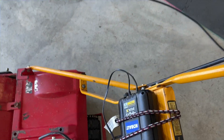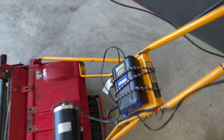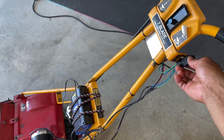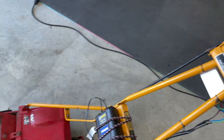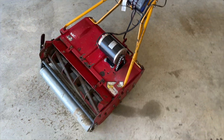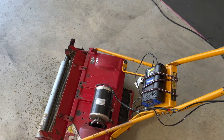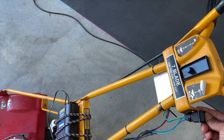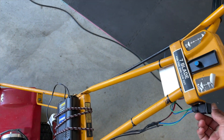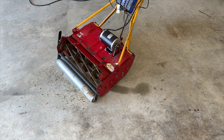It's as simple as this for me right now in this temporary setup — I'm just wiring to my positive and negative, and that gives me the power I need. I come over here, put it into forward motion, turn my knob, and we're operating. I can slowly turn my knob, put this in reverse, and I can actually back-lap, which is really nice. I was actually able to back-lap my blade a week or two ago.